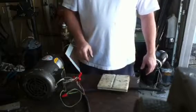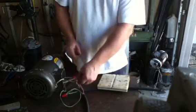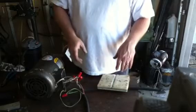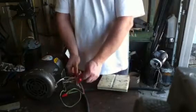I don't have an actual box, so I can't start the motor to show you exactly what it looks like when it starts, but your wiring will be exactly like this. At this point, if you wanted to, you could tape it, or you could actually put a disconnect right here — a contactor, a knife switch, anything that you wanted, maybe even a drum switch. You could more or less isolate this motor from the circuit if you wanted to. Or if you wanted to run just like this, the motor will run exactly like this without problems.